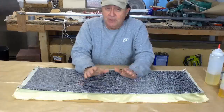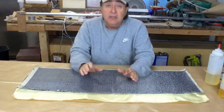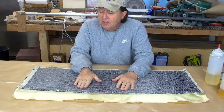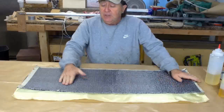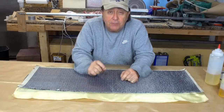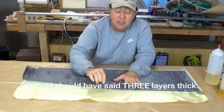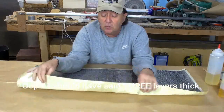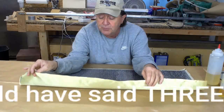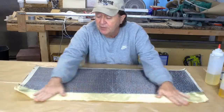And I do that for a lot of different assemblies because when you lift it up, it leaves the excess resin behind, and that helps hold down the resin content of the components that I'm making, which is always a challenge with hand layups. So you see here fabric for making a piece of tubing that is 4 layers thick for part of the pilot's cage, and you'll see that I have Kevlar and carbon fiber. The Kevlar that I have here is 120 cloth. It's 1.7 ounces per square yard. It's beautiful, smooth, fine fabric, quite popular in the aerospace industry for a variety of parts.